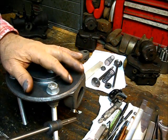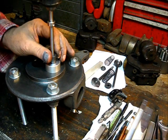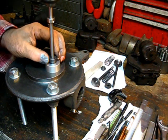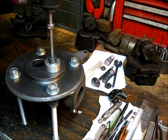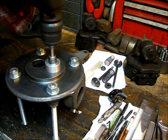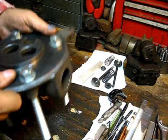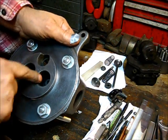No lubricant — no lubricant on cast iron; it will be machined dry. You can put a spring in this area if need be; I don't use the spring but some people do. You want some working clearance, and then we just ream the hole. That hole is reamed — perfectly nice and true to the seat.